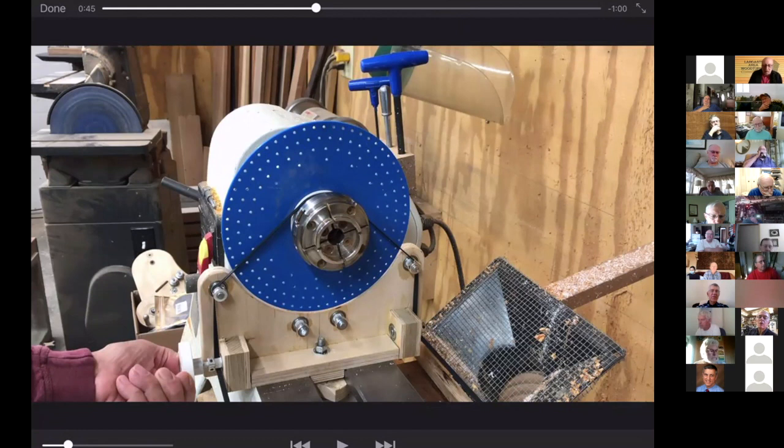Is that right? Yeah. In this case, if you look at the block right in front of my hand, it's actually 2 pieces of 1/4 inch Baltic birch plywood with about a 3/4 inch thick piece of, in this case, I just happen to have some sassafras scrap laying around. So it's a sandwich. And I drilled like a 1 inch diameter hole through the sassafras to give the shaft plenty of clearance. And then I had a little jig on my drill press so that I could drill consistent bearing locations. And I drilled through the 4 pieces of 1/4 inch plywood